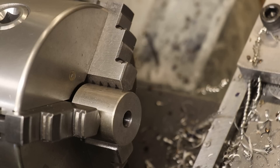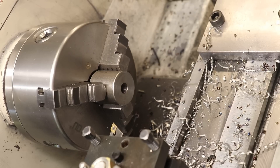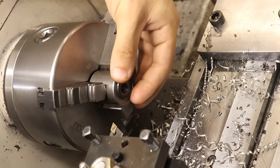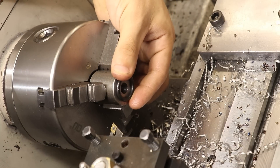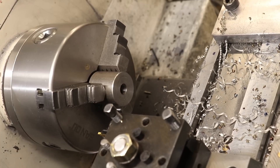I could leave the bottom surface like this, and many designs do, but I think the best designs incorporate an o-ring into the bottom. The reason for adding it is that it provides a bit more grip and lets you easily hold position as you swap from the centre finder to the punch. So I'll find an o-ring size that roughly fits — the exact size probably doesn't matter, just one that sort of looks right — and I'll use a parting tool to cut in a groove in the front face.